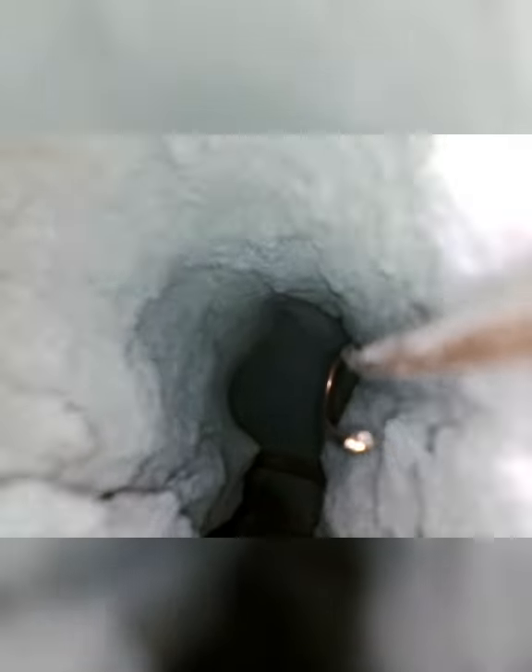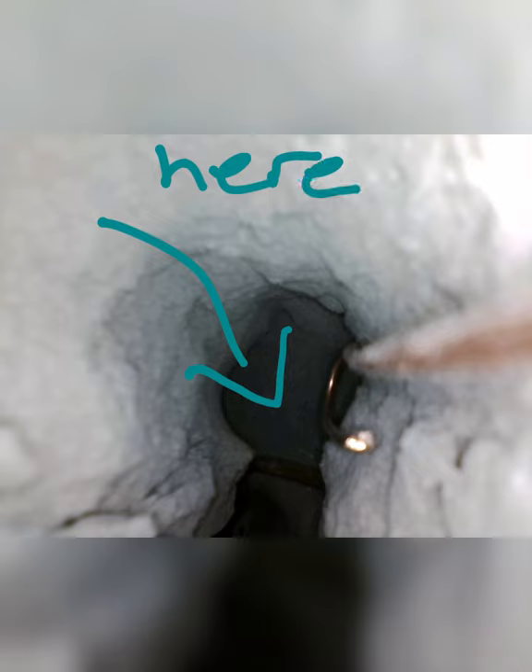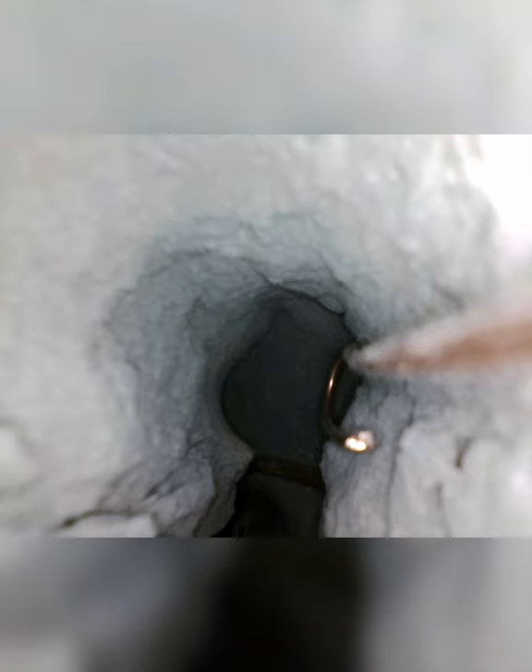As we dive into this hole, I'm going to explain how we managed to get to this point. If you freeze it right here — what we managed to do is drill a hole down behind the skirting board, then we also drilled a hole through the floor void. Obviously we got into the floor and made those two holes meet, and by doing that we were able to fish this brown cable, which you'll see at the bottom of the picture. The idea is that as we hook this draw wire up and put it into the wall, it creates a route through the floor void, behind the skirting board, and up the wall, so we can later attach our cables onto that draw wire and pull them up through the wall the same way.